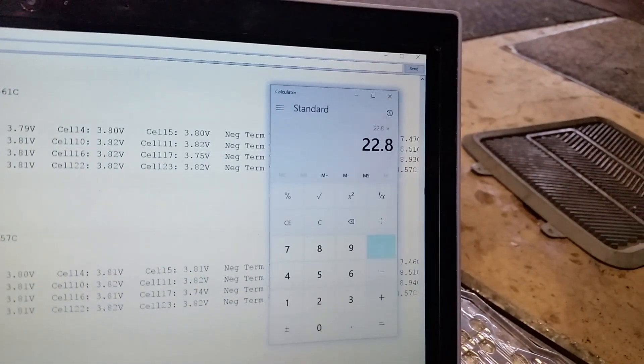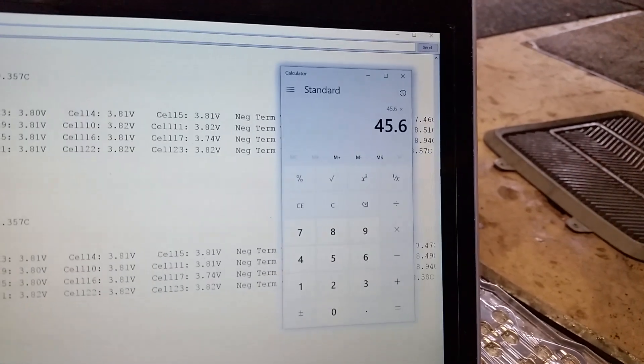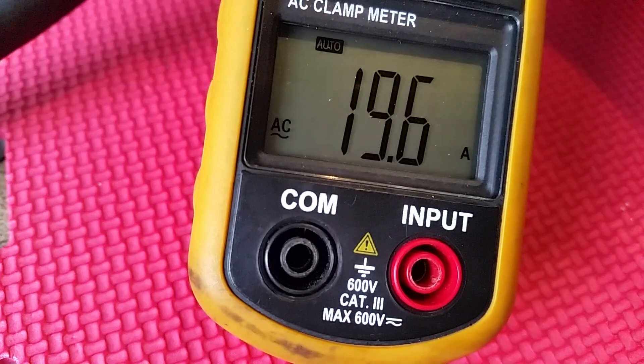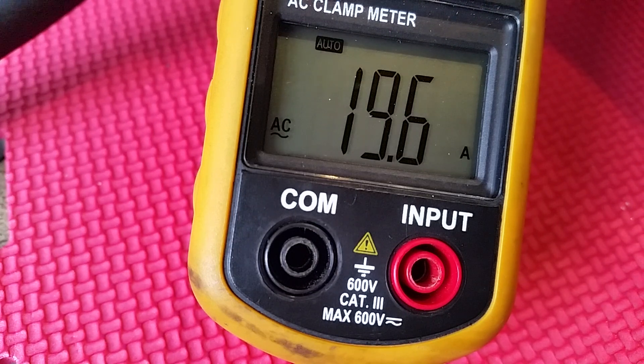All the batteries are 22.8 volts each. So that's going to be 22.8 times 2 times, let's say, 106 amps — still no red LED. So if this said 5,000 watt inverter, that would make a little bit more sense. And it kind of does say that, but it's really hidden and not very obvious. I find that very misleading and disingenuous — essentially dishonest of the supplier to do that to customers, which is why I'm pretty pissed off doing this.